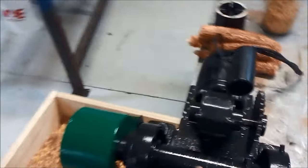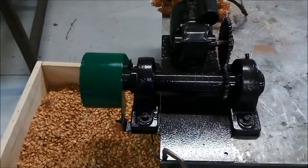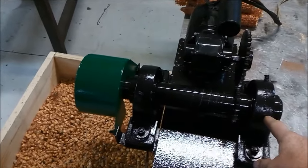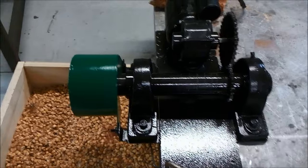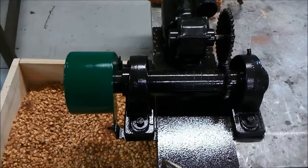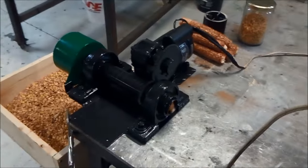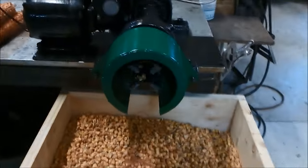I've got a piece of inch and a half schedule 40 pipe cut to 14 inches long, and I bought a pair of pillow block bearings that are an inch and 15/16ths — they slide right over that inch and a half pipe, you don't have to do any machine work on them. You just tighten the lock collars up and it works perfectly. I'll plug this in right now and let you watch it. On the front side I used the same principle with the four cutter bars.